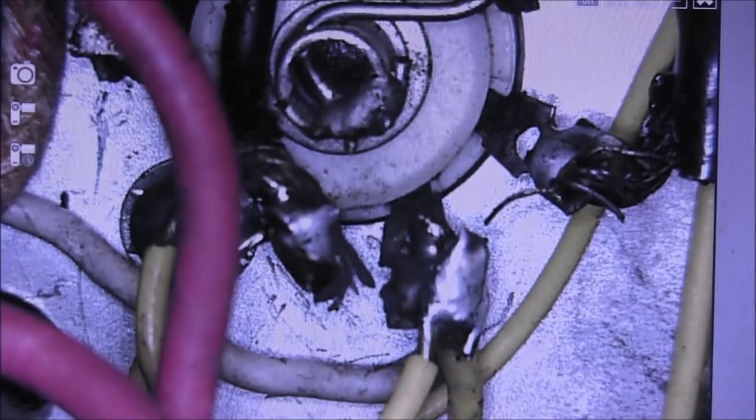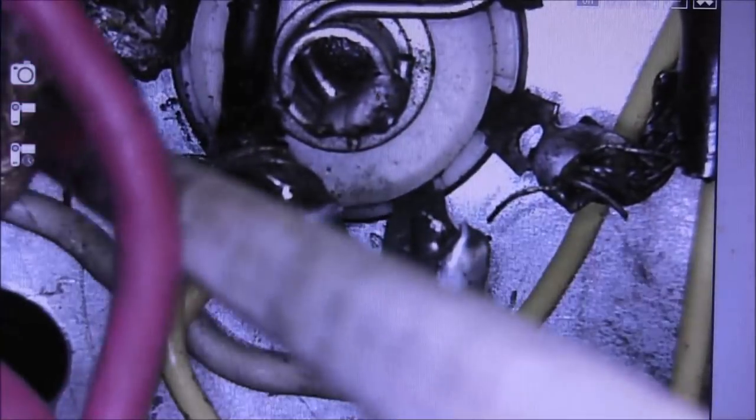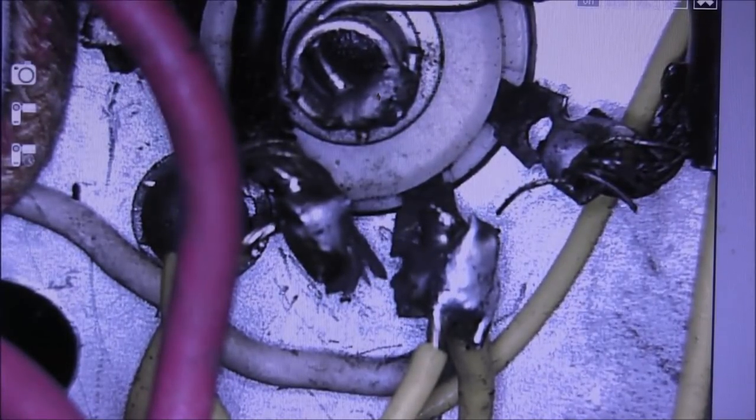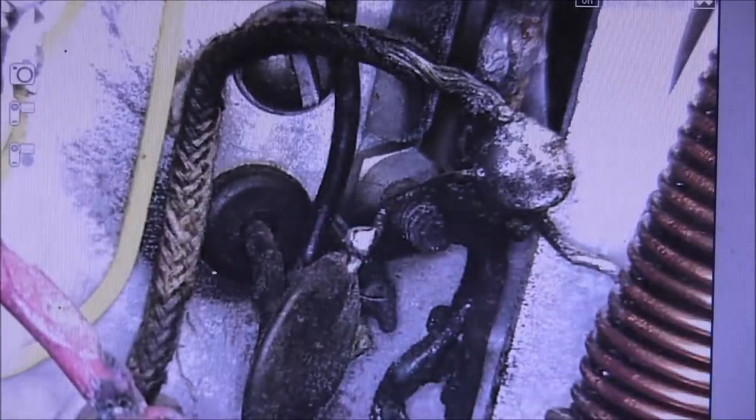Looking at the base of this tube, these are the two negative capacitor leads, and you can see how they just run around with all the frayed wiring sticking off of this stuff. It's stuff like this that will cause major problems if you don't go ahead and take care of it — especially with arcing. Just very poor wiring on this. Over next to it, you can see all the insulation is burnt off and it's right up against this solder terminal. The burnt wiring down in here has to be replaced — you can see how they just burnt the wiring, not paying mind to where the soldering iron was at. Got to strip all that out and get it all fixed up.